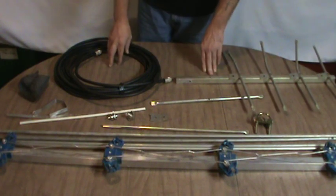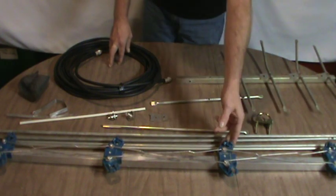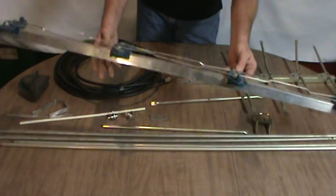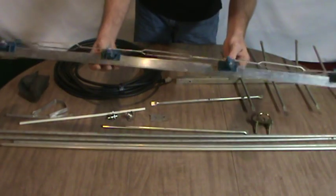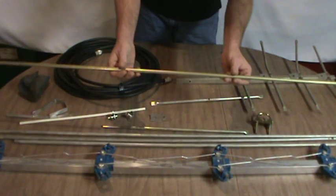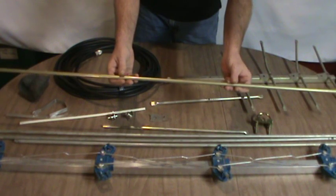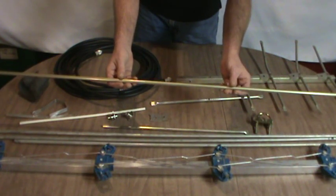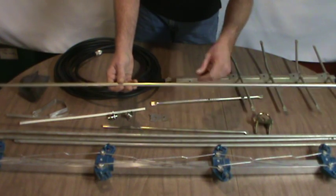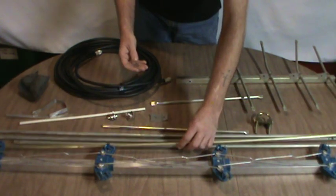So that's all the parts that we need. If you don't have an old TV antenna, the boom is just one-inch square aluminum. For the tubing you would buy 3/8-inch, and the aluminum you really want for antenna elements is T6061 — Tango 6061 — aluminum.